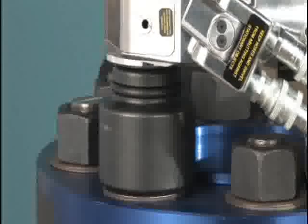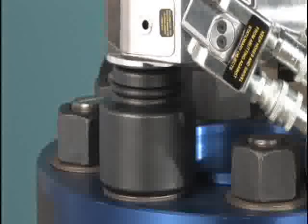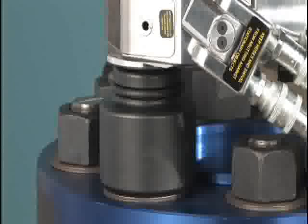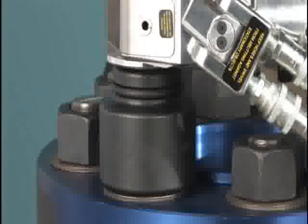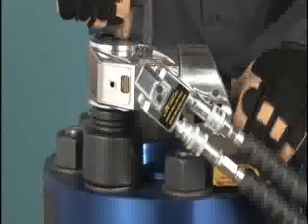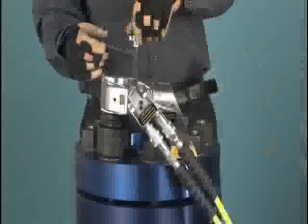Be patient on the last few strokes, as the socket will move very slowly. If in doubt, always try another stroke. Remove and reposition the wrench on the next nut to be tightened, and proceed with your bolting plan. Often, bolts are required to be tightened in increments rather than all at once. This is done by choosing a lower pressure corresponding to the percentage of final torque desired on each pass. Reset the pressure in stages until the final value is reached.